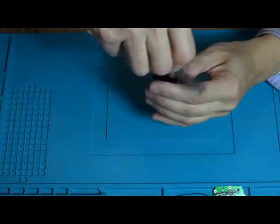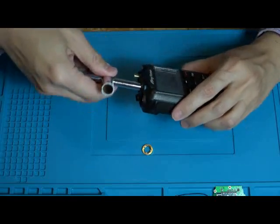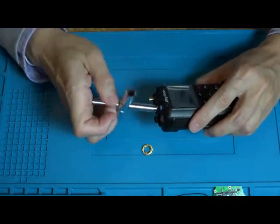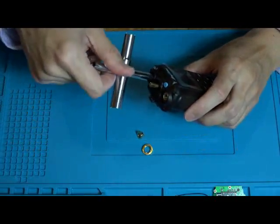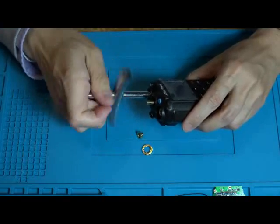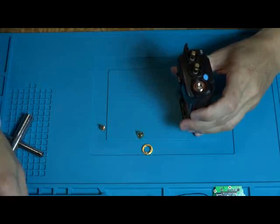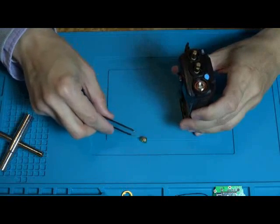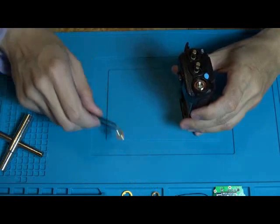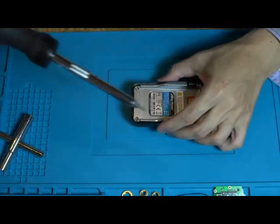The first thing we did was pull the knobs off. This is a great technician, so this will be a great video for you to watch. He's undoing the retaining nuts on the antenna connection, the volume control, and the channel selector. You can do this with a pair of needle nose pliers — the tool makes it nice, but it's not essential. If you're doing a lot of radios, a tool like that is helpful, but tweezers work really well on the antenna connector for getting it started. Needle nose pliers can loosen and tighten these nuts.